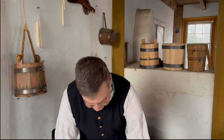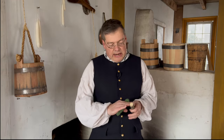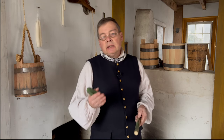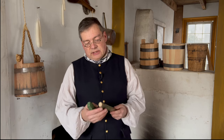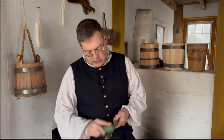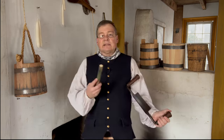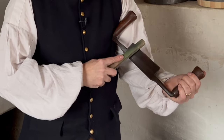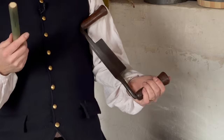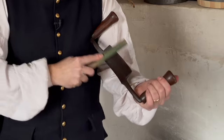Once I have that edge worked with the diamond plate and dried off, it needs a strop. What I did here is take a three-quarter inch dowel, took that same leather and glued it smooth side down onto the dowel, giving me a round strop. I charge it with chromium oxide, then take that same motion — pushing and rotating — for maximum contact along the length and width of the round strop.